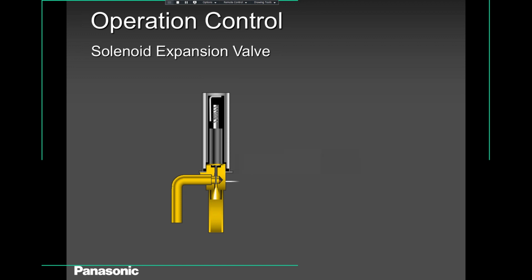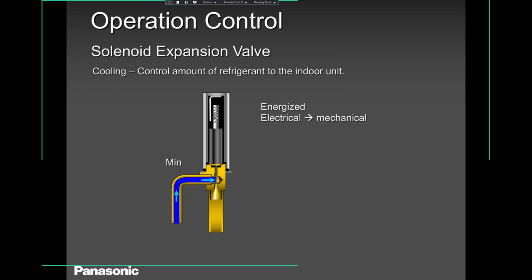Then we have the valve pin that moves up and down. The valve body, and those are the pipes. Valve chamber, the stopper. So guys, now you will watch when the electronic expansion valve is opening gradually. It's opening very little. Right now you can see the flow of refrigerant is so slow because the compressor is hardly running. As you can see now, it's starting to open slowly.